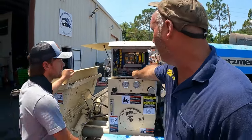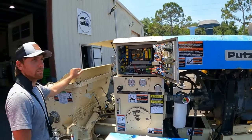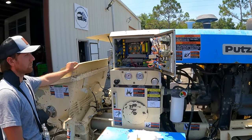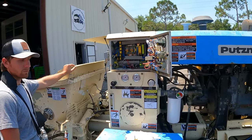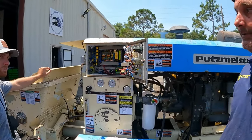Now, this keeps the energy off of what we were talking about, your proximity switches. That's a reverse diode or something. Yeah, it turns on and runs through one way, so if you wire it the other way, it won't run. Correct. So when you call me and say, every time I put it in forward, I blow a fuse, it's a directional diode that went bad.